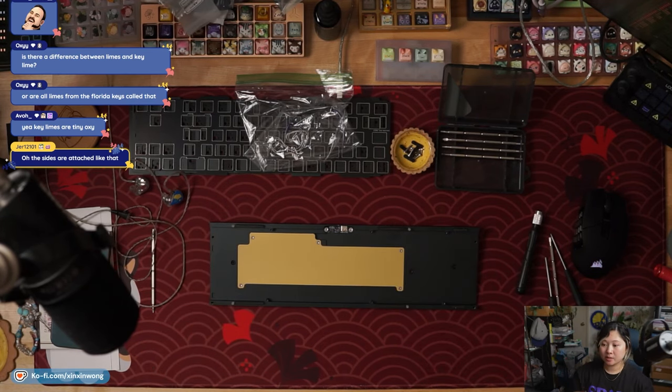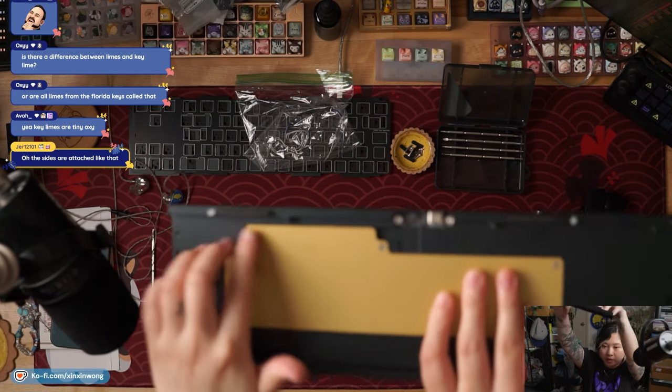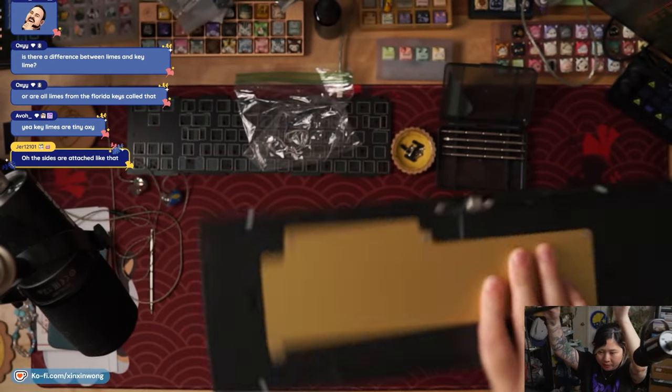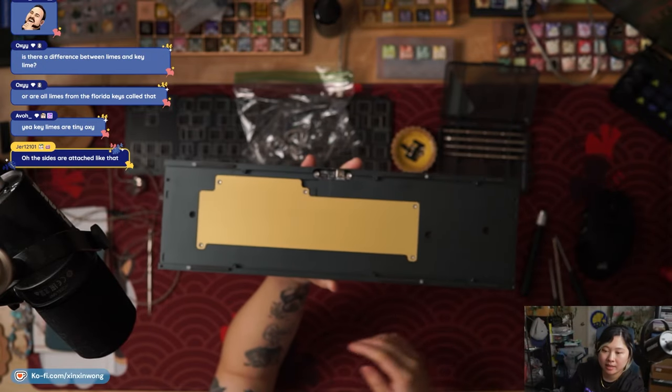So the gaskets go on the bottom and not the top. And this is a single-sided gasket mount. Here you can see the gaskets. Here you have little pegs as a force brake and also to catch the top piece as alignment tabs. So, 6 gasket points.